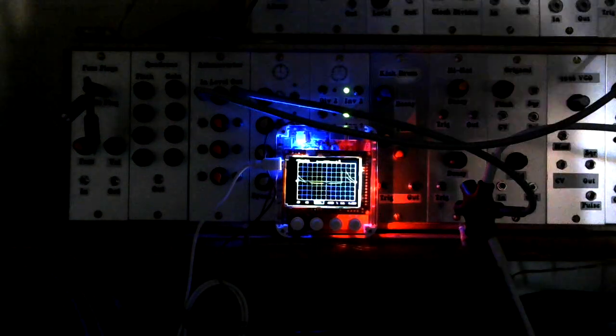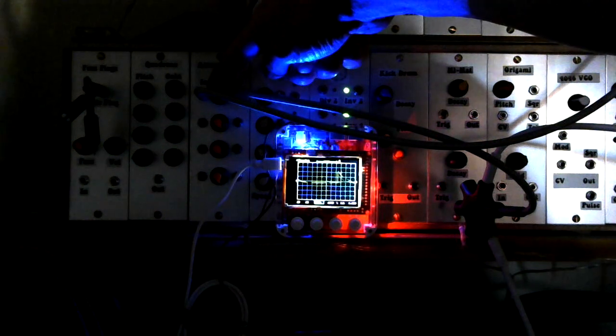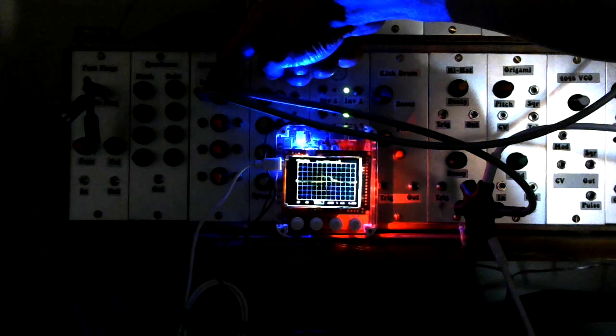The control, it's a bit difficult to see because I've turned the light down so we can see the scope, but the control on the attenuverter is hard right, so it's full non-inverting at the moment. Now if I start to turn that control, you should be able to see the peak of the output dropping, and you should hear the effect on the filter changing.